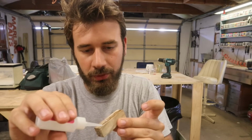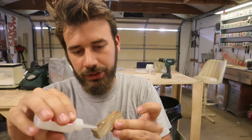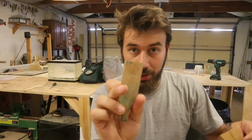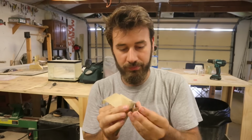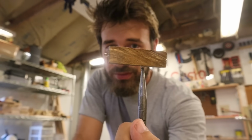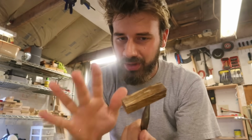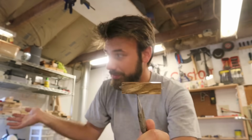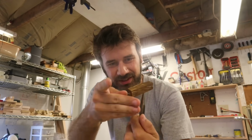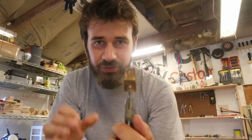Whoa, this stuff really absorbs the super glue. That's good. We're getting a good seal. Smoked up. Gonna use a hardwood block with some 220. I decided we're not gonna clear coat this. I sealed that really well, and it's smooth, and it's perfect right now, and it's more like a block of wood right now than if I were to put a clear coat on it. It would round the corners off and stuff, and it's fine. Like this, nothing's gonna be able to penetrate that wood with that super glue sealer.